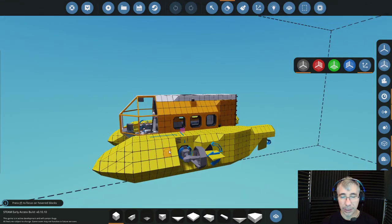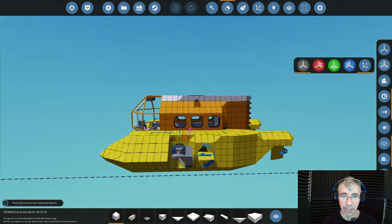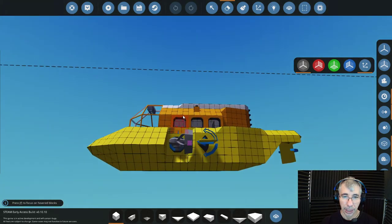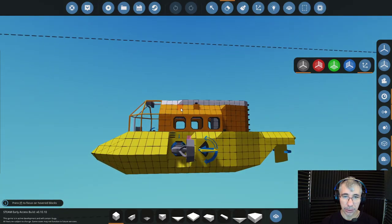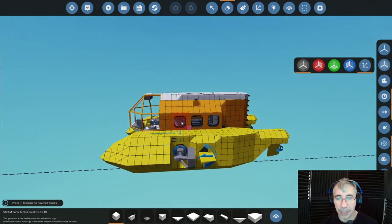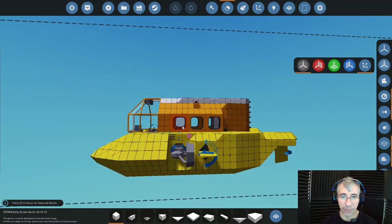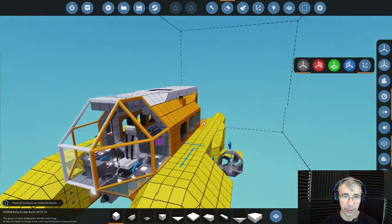to get it right. And when these tanks are flooded, then the physics is different, because you see here the center of mass, right? The center of mass is conveniently placed in such a way that it's close to the center, let's say, of the vehicle, and these propellers are also aligned to the center of mass. This is important because then you don't have extra torque generated by the propellers. If they are significantly off the center of mass, you will have weird rotation effects caused by the propeller. So all this has to be taken into account.